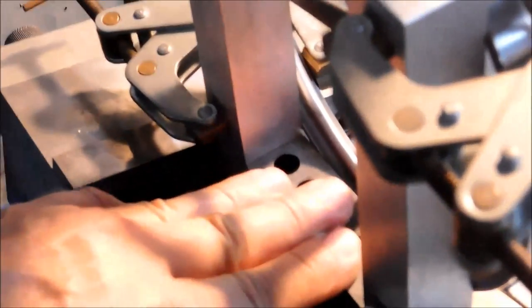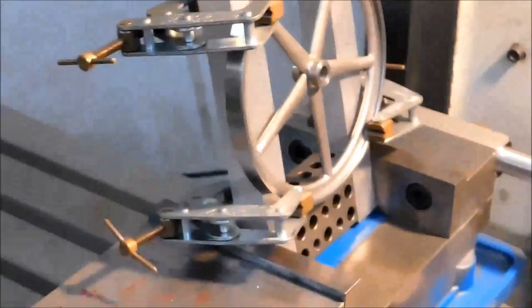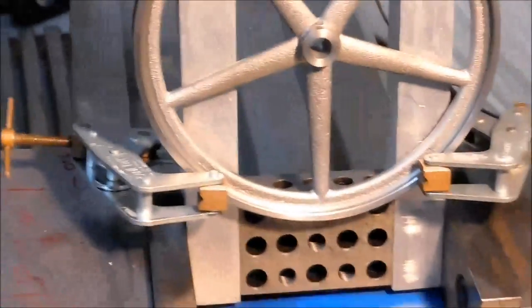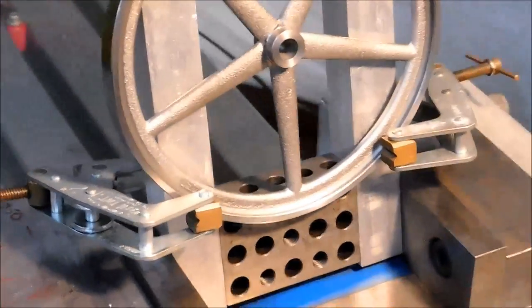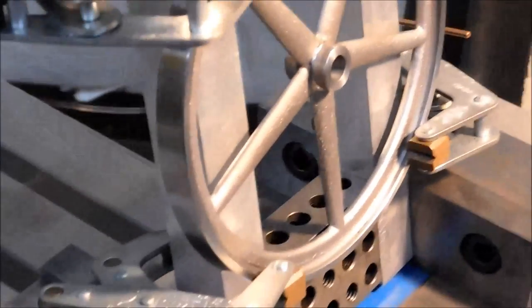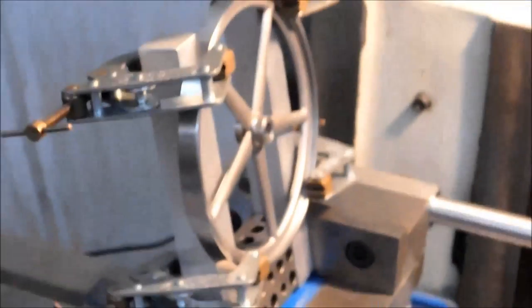But if you don't, like I said, just make sure this block right here is the one clamped to the table. Toe clamp it down and then squeeze these outriggers on. Clamp the part to it. It's a very small hole, very low load. But you may need a pulley tap to do it. It's going to be a pretty tight squeeze in there to get that tap down in there. So maybe in the next video I'll show you how to make a pulley tap. For now, that's all we got.